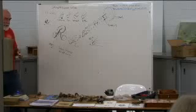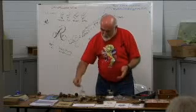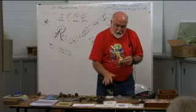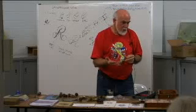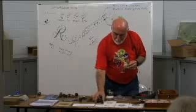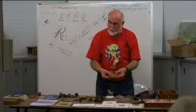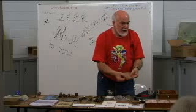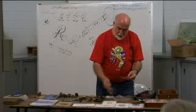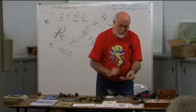Even with a lovely, perfectly sharpened tool, the resistance in the metal can quite surprise you at times. And you may prefer, if you're going to get into this, to perhaps use zinc or even a piece of aluminium to practice on when you first get going. The beauty of copper, and this is a book plate that I made for my wife, the beauty of copper is that you can do many, many impresses off that, and it lasts very well. I could maybe get between 500 and 600 impresses off that plate before I would need to perhaps touch up some of the finer lines.